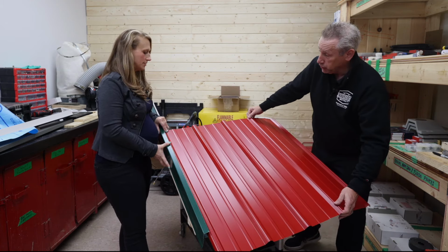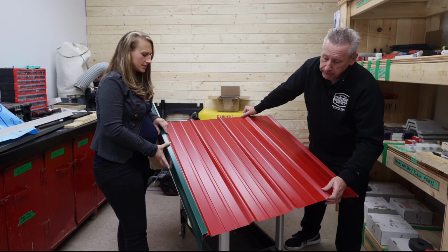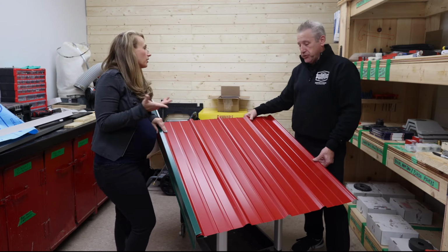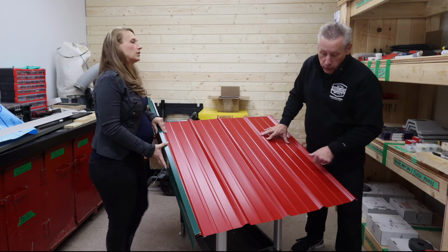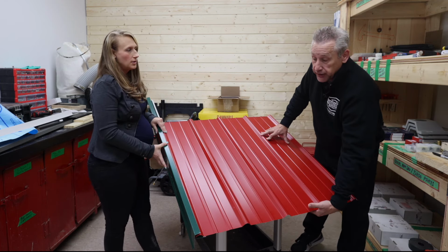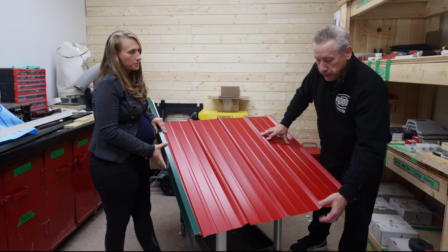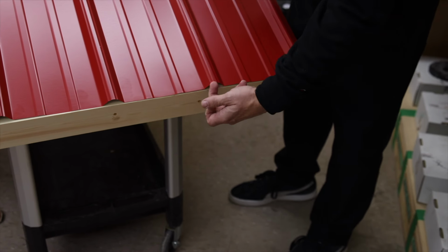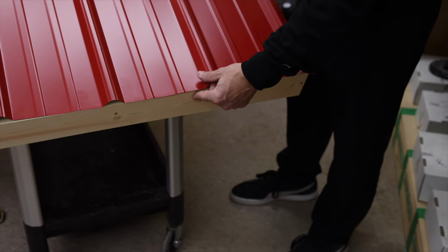Okay, so if I look up, I'm going to pull the panel up a little bit here. I think our roofing guides, we kind of budget for at least about an inch overhang. 100%. You want about an inch. And the reason is that water will come and then drip back. If it does, the end is there, which is great. But you want to make sure you have it off the edge. If you have it right to the very end of the roof line or that trim, it can actually roll back up underneath and in the area it's not protected. So you want to have it down an inch.